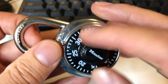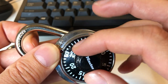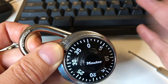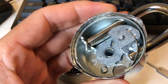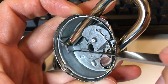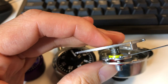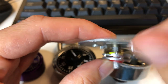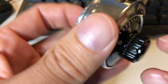The way you get the first number is you pull up on the shackle slightly and find the number that's catching as you turn the dial around in a circle — in this case 25 or 24. You add five to that and you get the first number, which we already know is 30. The reason that works is there's a flaw where the shackle retention clip, when you pull up on the shackle, interacts with that bump and you can feel where that bump is. That bump is always offset by five when turning clockwise from the right number.